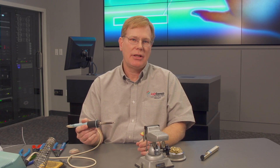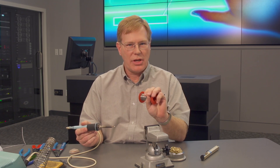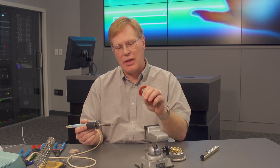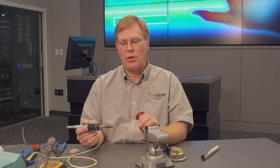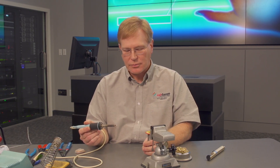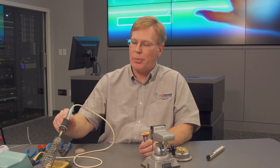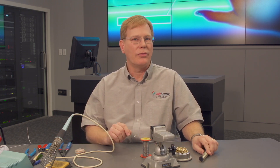The material needs to be cleaned. Use flux as a cleaning agent — most of the solder you'll be using will have, at the core, a rosin type of flux. When you apply this to the joint, you'll see a little smoke come up, and that's the rosin burning off. That rosin is going to come to the surface and remove impurities such as rust, oxidation, and any dirt, so that you have a clean joint to solder to. If you have to go back and redo a joint and you touch the solder more than twice, because there's no more flux left in the joint, go ahead and remove the solder out of that joint and start all over again.